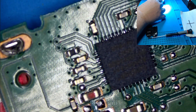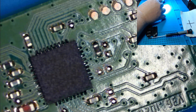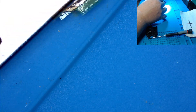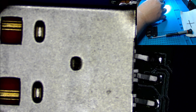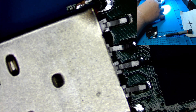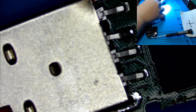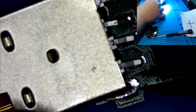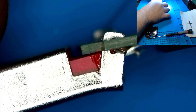We can see visually damage on these termination points — solder cracking and such. I'm not seeing any issue component-wise; nothing appears to be a cause for concern. On the other side, we see additional physical damage. That one pin is still making a connection, but this one right here physically is not — it's actually lifted up from the board, and the pad has come up with it. It looks like that trace may have run through here. We're going to take the USB connector off and attempt to repair it, reusing the connector to get it onto another thumb drive.